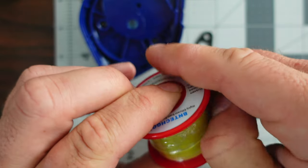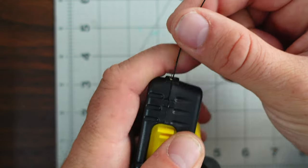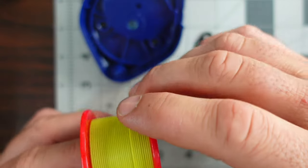With the yarn removed, go ahead and add your antenna wire. There are a few considerations when choosing wire. With the Pittsburgh chalk line from Harbor Freight, I noticed that this poly stealth-like wire gets scraped — the outside coating gets scraped away because the eyelet inside isn't smoothed out. I recommend not putting that eyelet back on after winding. Ultimately, with the Irwin I decided on 30 gauge BNTech Go wire — it's silicone coated, small enough to fit at least 100 feet on the reel, and that was appealing to me.